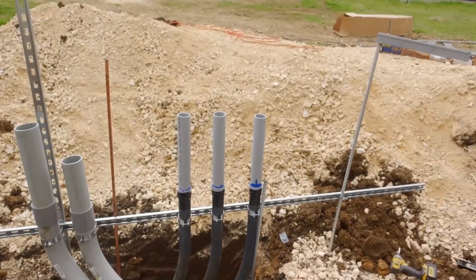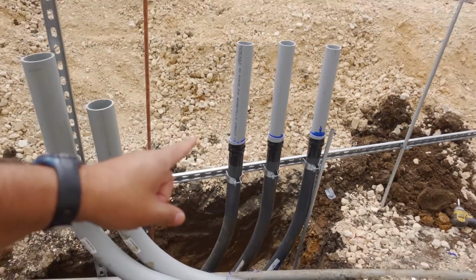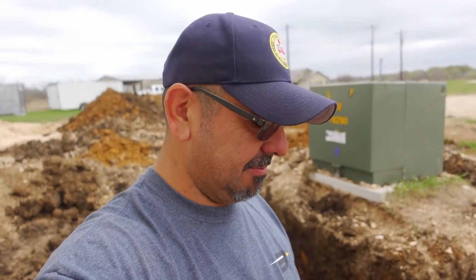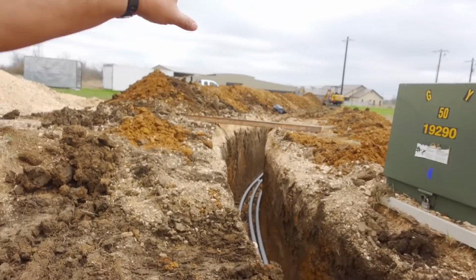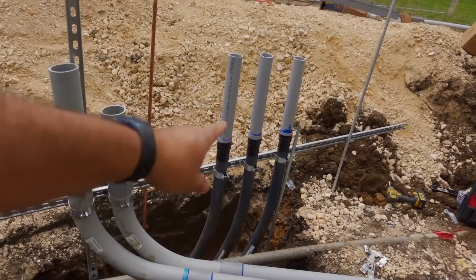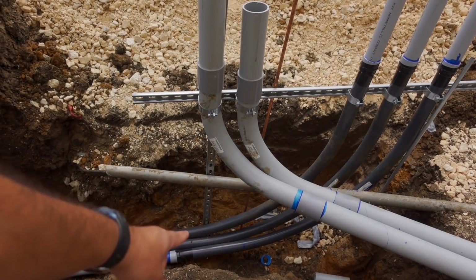And of course, I knew we were gonna pass because we had one of their guys come by yesterday and tell us the thing that we were doing wrong, and we fixed it. Oh, one other thing they told us is those pipes need to be 80 inches from the building. Well, they're 82 inches, because I give them a little extra, right? Because we don't want them to fail us. He shows up today, again, approves all of that. He gets to here, and he says, those are good, but these need to have long sweep rigid 90s, like the other ones.